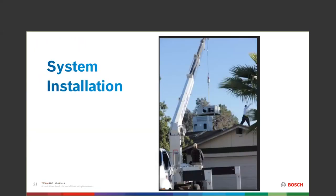We're looking at a picture of an install. Take a look at the old unit coming off the roof and the new IDP being installed on the roof. Left and right, pretty much the same; front and back, pretty much the same. But look at the height differential. The reason for the 19 SEER rating is coil space inside the box. We worked hard to keep the same footprint as the old unit so it fits on the curb for a retrofit application with minimal field modifications.